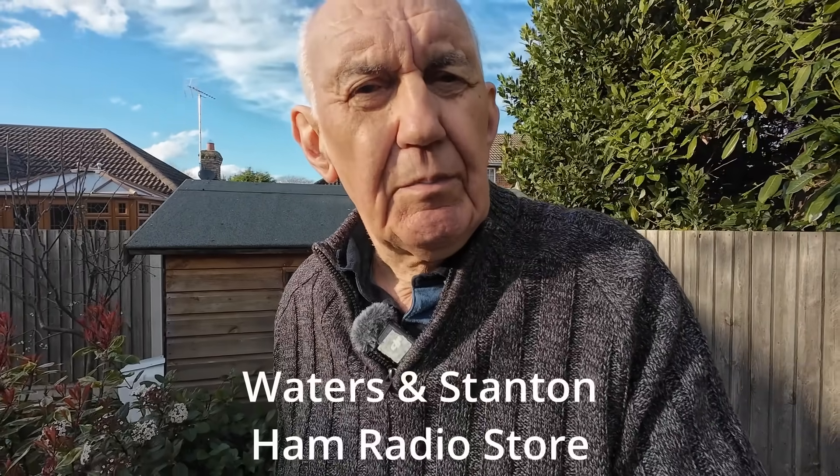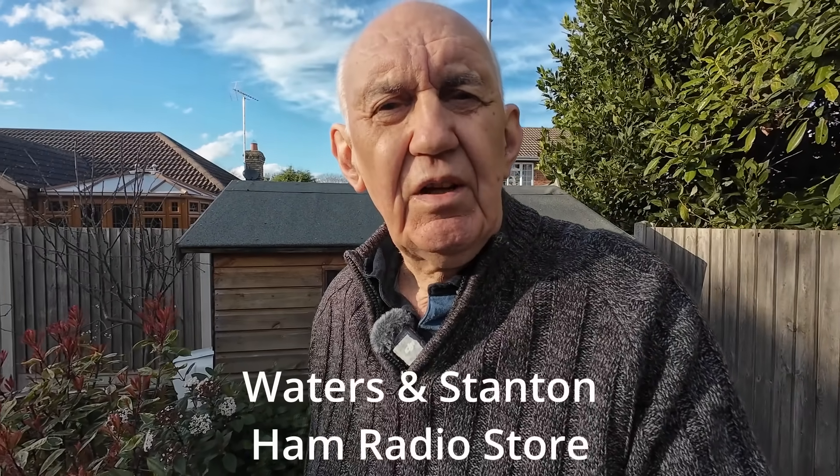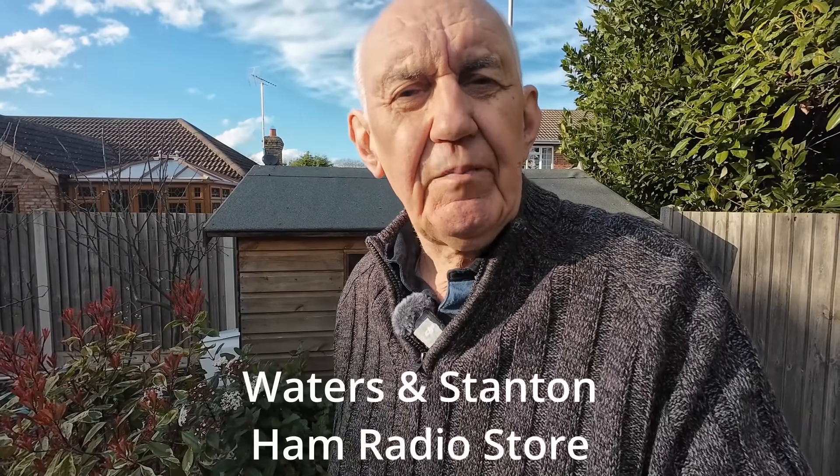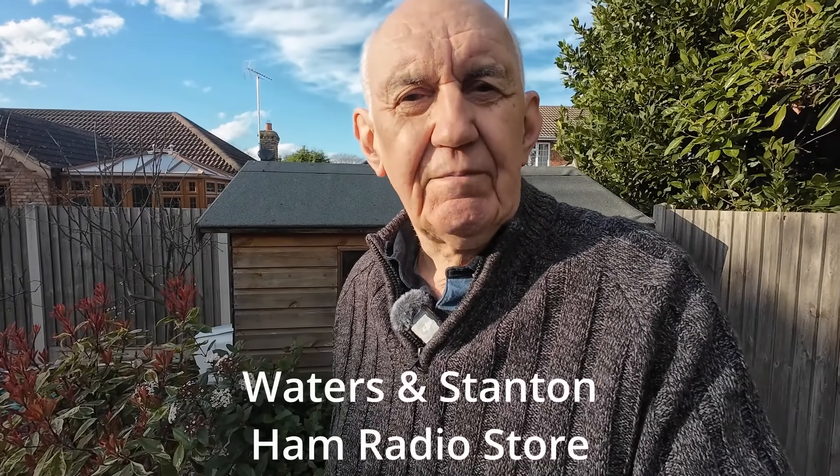Below this video, I'll put a link to the antennas and also to the telescopic mast I used. If you've got a situation where you lack space, then this might be the answer. As regards directivity — yes, it is directional, not super directional, but as you lower an antenna to 15 or 20 feet above ground it does become more omnidirectional. There is directivity to it — probably around about 6 or 8 dB as you rotate it, depending on the angle of radiation. So there we are — that's a compact antenna. If you're thinking about using something like this, don't hesitate, it does work. Enjoy your ham radio, take care, and look forward to seeing you in the next video. Bye for now.